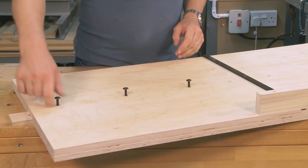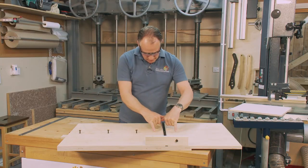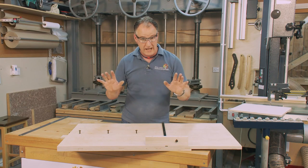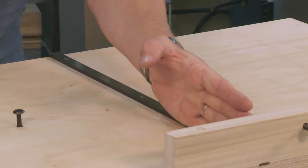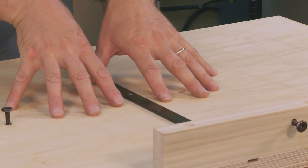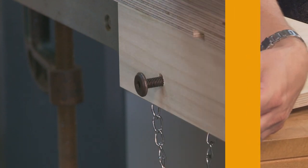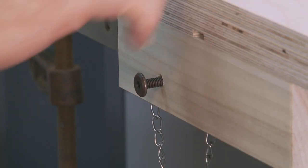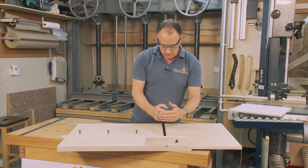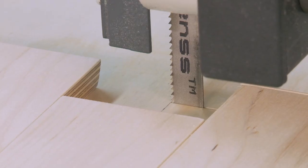These are my screws that I'm going to tighten down to hold my dovetail baton in the right position. I've got two extra screw holes in here because this jig could also be used on other machines in the workshop. I have a slider bar that's been routed or dado'd into my plywood for the right position. On the front here I have a piece of timber fixed which acts as a reference against the front edge of my table, with an adjustable screw as a fine adjuster so I can get my bandsaw to the right position depending on whether I have a narrow blade or a wide blade in there.